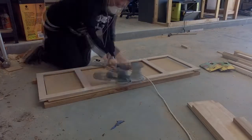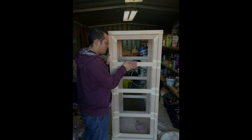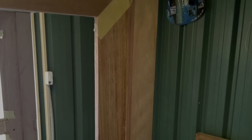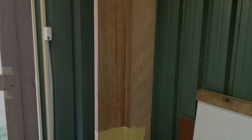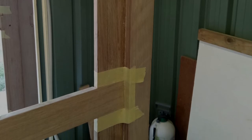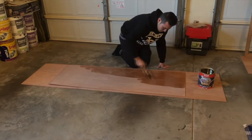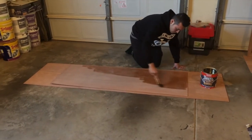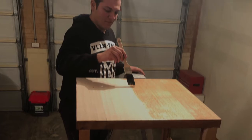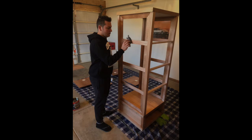The next process was to sand the project. We began using 80 grit paper and worked up to 320 grit for smoothness prior to finishing. Particularly with the mitre joint frames and the cross halving joints, I had to consider the varying grain directions. I put tape on areas I did not want to sand at a particular moment to ensure the timber was not scratched. Once the project had been sanded, I began finishing using a clear varnish. This created a satin finish bringing out the natural colour and end grain of the timber. We applied three coats to protect the timber in a dust free environment. Steel wool was mildly rubbed in between coats in order to achieve the best finish.